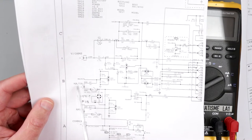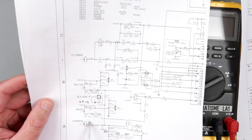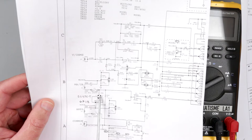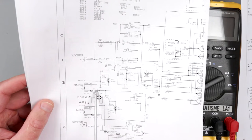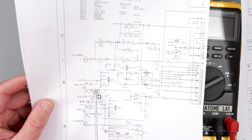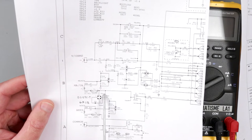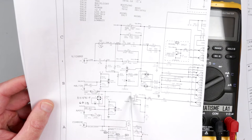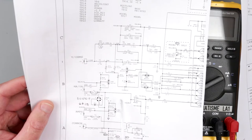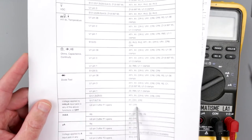This protection circuitry is used to protect against short circuits when you apply voltage across the amp input terminals. If the fuse blows and then a large voltage or current event occurs, the bridge and diode can be blown as well. Also need to check resistor R7, CR5, and CR6 — these are downstream after F1 and around U2 pin 3. I'm going to go through and check all those components one by one.